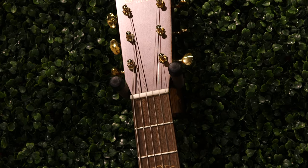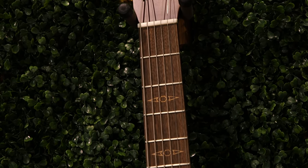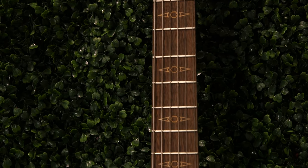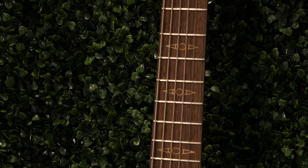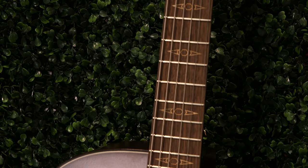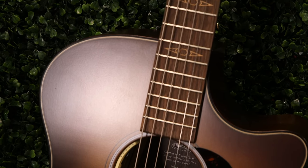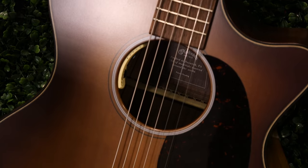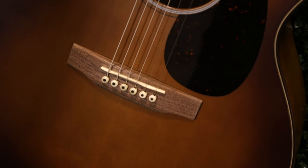Like anything else, I use this analogy: when you change a key ingredient in your recipe, you're probably going to have to adjust the recipe a little bit. That was sort of our thinking with this particular guitar. So we started by changing what essentially is the dynamic engine of the guitar, which is the top. We really wanted to move the bracing around — if we could get the top to be a little more responsive than normal, we could get a little bit more out of the maple. So the way we started that was we did some weight relief on the braces on the inside.